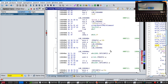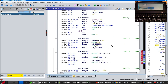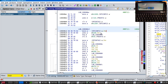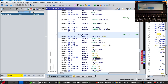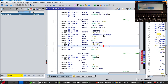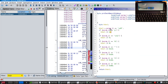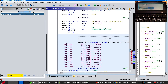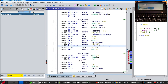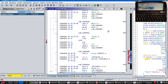My suspicion, and this is based on a suspicion and nothing else, is that this is an incredibly simple device. And what you do is you wait for an interrupt to arrive, and then you clock out a random byte, and you clock in a scan code from the keyboard. It does seem to be doing several things, and there are in turn these subroutines. This just maps what I believe to be scan codes to modifier keys. This does basically the same. So this would seem to be basically everything we need.